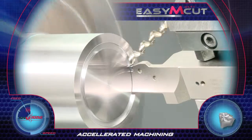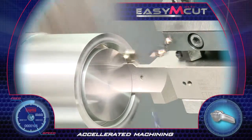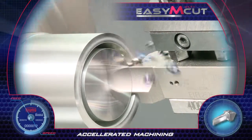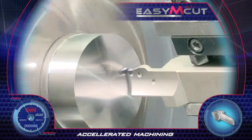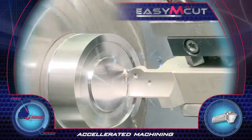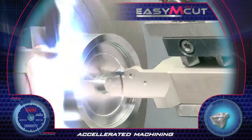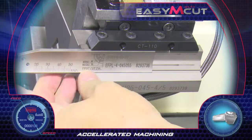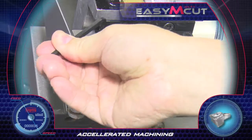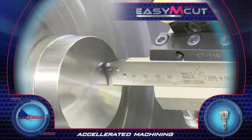In deep face grooving applications, Easy Multicut is the most efficient solution. The rigid tool was specially designed with a top section which allows free chip evacuation and enables high machining under extreme conditions that effectively reduce cycle time. The new blade system for face grooving and face turning applications is the only system that enables adjusting the overhang to achieve the desired groove depth.